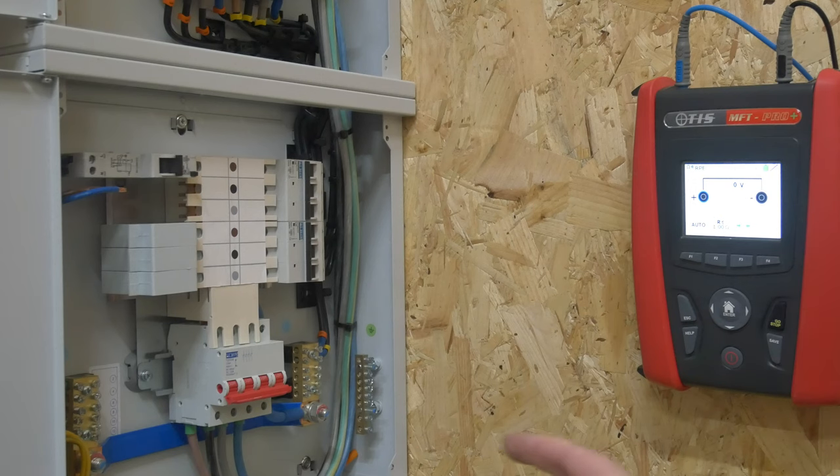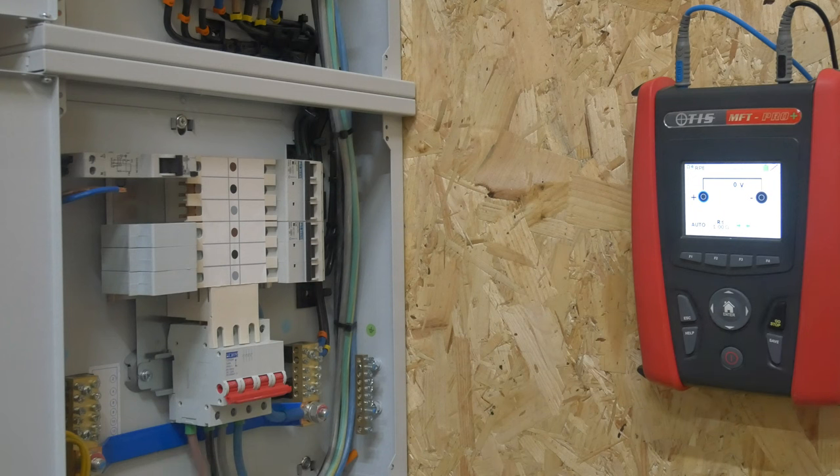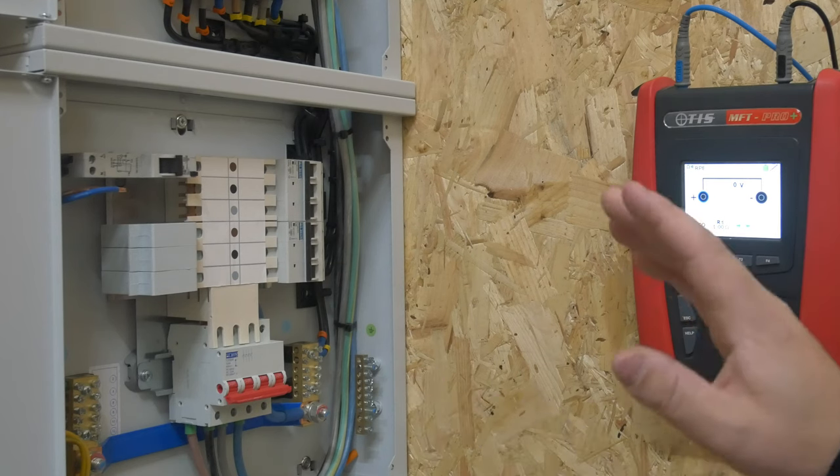For the minute I've shorted out between L1 and the CPC. Now if I test between those two parts I should get a value of resistance, and then we need to repeat that process between L2, L3 and neutral — this should all be roughly speaking the same. I'm not going to disconnect the earthing at this end; we're going to class it as all part of the same system, and when we come to our value of ZS later on this would be ZDB.